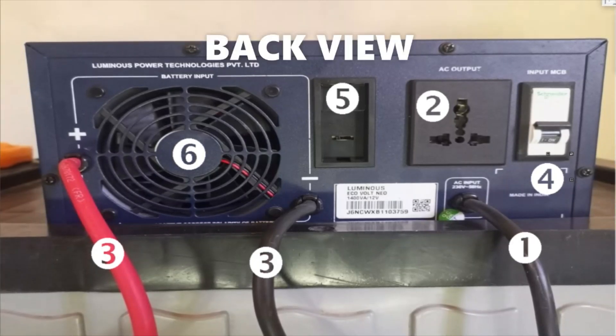The red color cord is the positive while the black color is the negative. Four — main or AC input fuse. The AC input fuse is connected at the input of the UPS, and it will disconnect to save loads in case of short circuit or overload. The inverter will not detect AC power and will continue to operate on battery until you press the knob to reset it. Five — battery type selection switch. This switch is used to select the type of battery you are using.